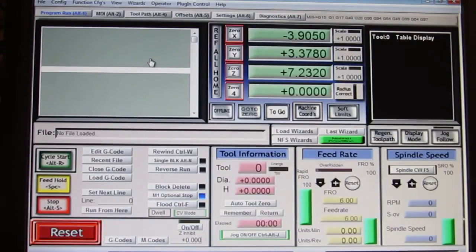And even though on a Harbor Freight mill the surfaces are heavy, the cross slide and the tabletop there are pretty heavy, and the head in the Z-axis is really heavy, okay? So there is a lot of mass to move. And so what we need to do is choose what we think will be a reasonable speed. I chose 120 inches per minute, which works out to be 2 inches per second. And even that, I think, is way too fast. But that's what I chose.